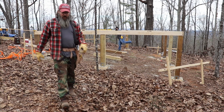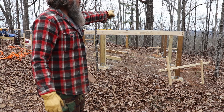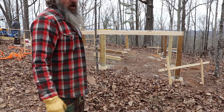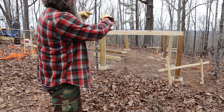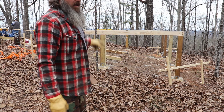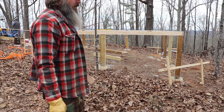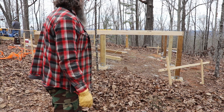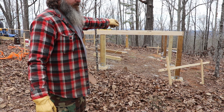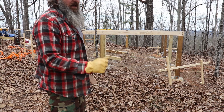So this corner down here — from this corner to that corner we're an inch long, and from the northeast corner to this corner we're about an inch short. We're going to try to pull these two together so they'll twist it just enough to get this thing squared up. Then we can hang the joists and throw the flooring down. Same thing we did over here — put a couple screws, a couple ratchet straps, and we'll go click by click until we get where we need it.